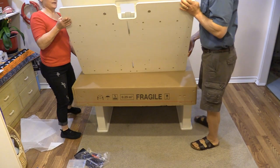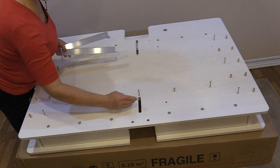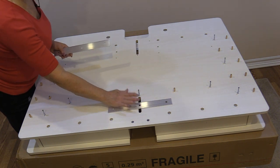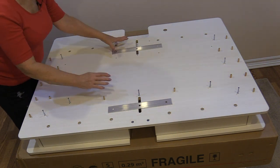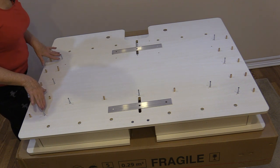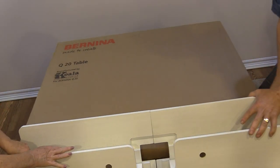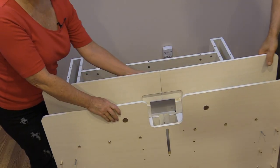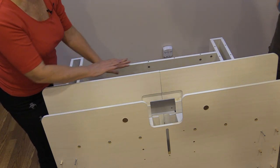We have the two legs and this back brace. We will need to put a series of dowels and screws in the tabletop but we can do that standing up — just take one of the tabletop boxes and put it on top to protect everything from getting scratched. Now we can take that tabletop and put it upside down on top of the table. As you're lifting it upside down, remember that this does slide open, so keep that in mind. Start with putting that one long metal screw right in front of that long hole. You'll find two mounting holes right beside this long piece that will work when we put the table upside down.